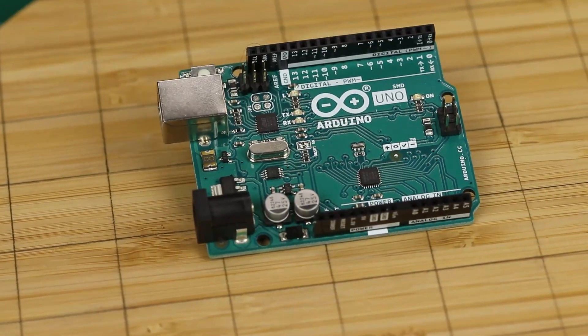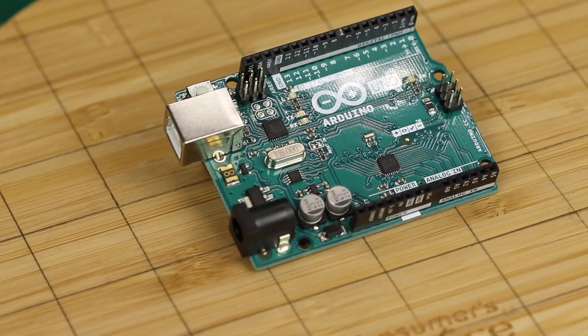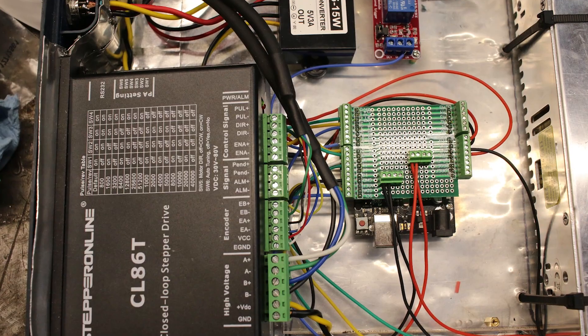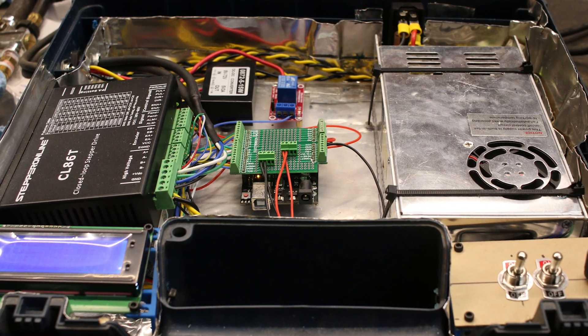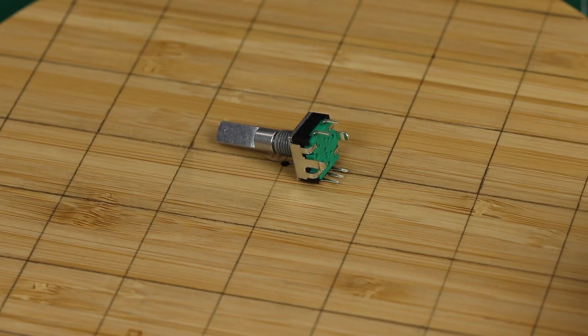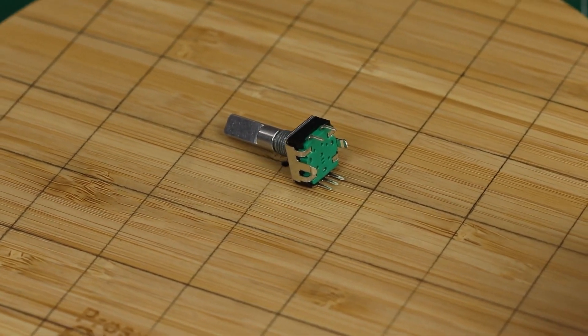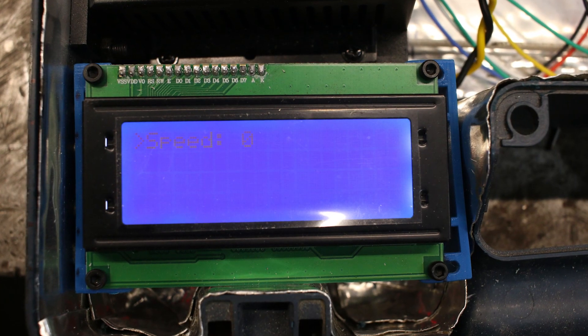For the microcontroller on the rotational positioner I chose a simple Arduino Uno, mostly because it's available and people have experience with it. If my client needs somebody to work on it and I'm not around, he can find anybody with some Arduino experience who is most likely familiar with the Uno. A rotary encoder in combination with an LCD screen allows me to build a pretty cool menu system using standard libraries, which I can use to set variables for pulse time, triggering the welder, and all kinds of stuff like that.